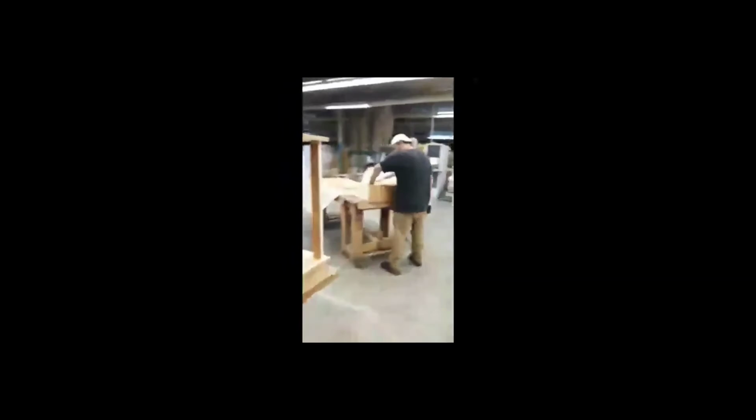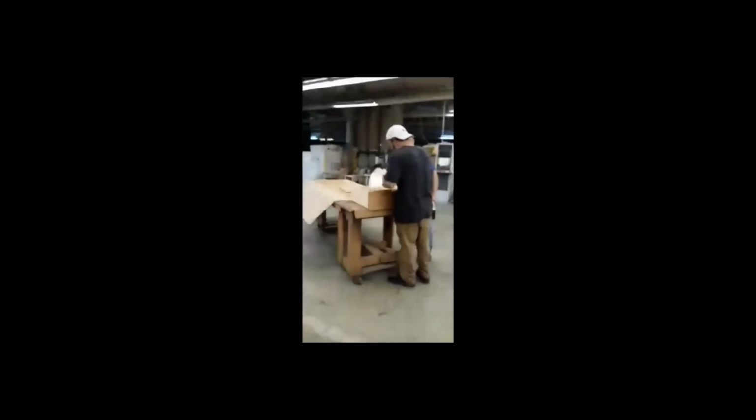Come back to your drawer kit. Get your four base blocks out. You're going to want to glue this side and this side. Feet come down to the bottom, goes in the corners. Use the same 92708, 1 1/8 inch screw. We've got little cutouts here for where the glue can stick to the side of the panel.